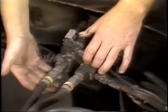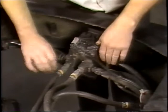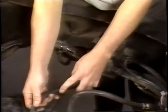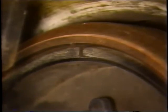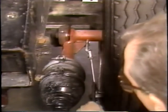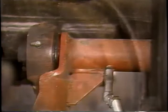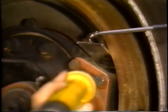To perform a minor inspection, begin by checking the air system for leaks, loose fittings, bent lines, and lining wear, which includes checking the chamfer at the center of the shoes. It's important to note that if the chamfer is not there, the brake shoes must be replaced. A minor inspection also includes lubrication. Start with the camshaft, and when lubricating, check to see if grease flows from the seal near the cam head. If leakage is observed, remove the wheels and brakes to replace the seal.